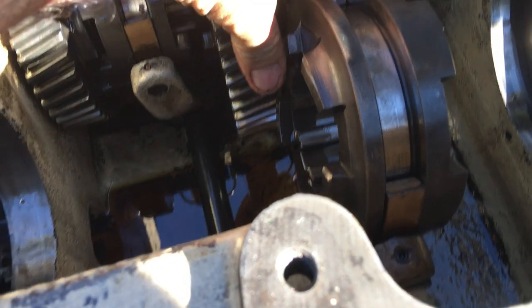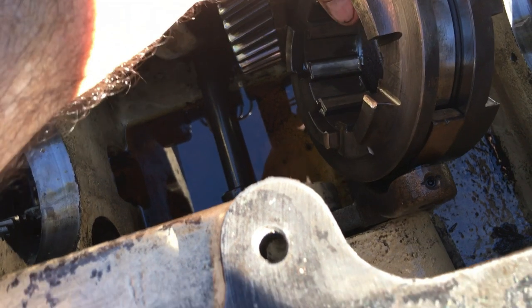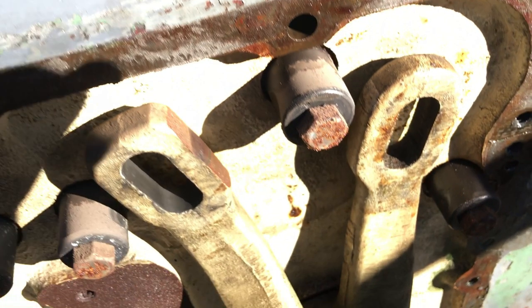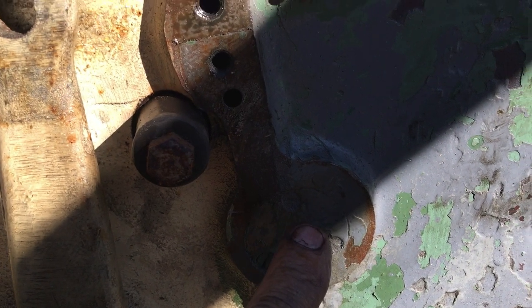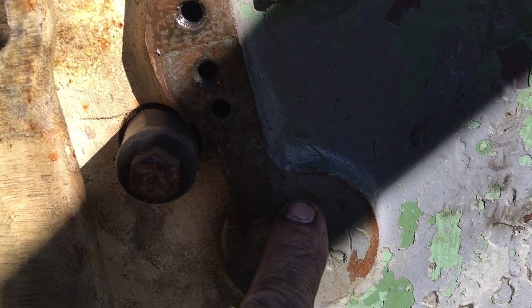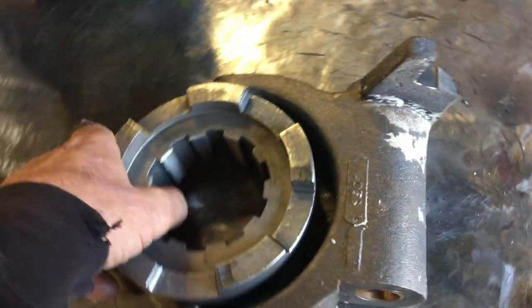Jumping back over to the donor lathe — I'll show the plate on the outside with the three screws. There should not be a hole in it; that plate seals it off. You take the three screws out, take the plate off, reach inside, and pull the shaft out. The only things that hold the shaft in are the set screws on the inside. Mine had a hole in it with a bolt screwed in — that bolt should not be there, and that hole should not be there.